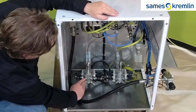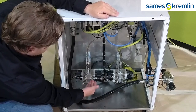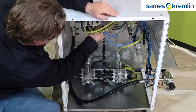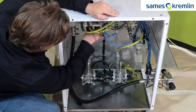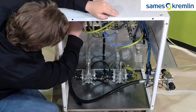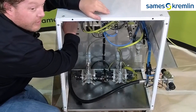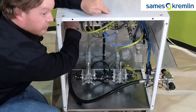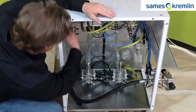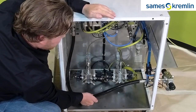Looking back here at our catalyst valve changer, depending on our recipe that we select, our catalyst will exit the assembly through this stainless steel Teflon braided hose through our component B flow meter. Again, the catalyst will travel through a check valve into a ratio test valve, through that ratio test valve into our VP6 catalyst injection valve. And our catalyst will be injected in small quantities into a continuous flow of our resin material. From there, we'll travel through a 3-foot by 1/2 inch mixing element.